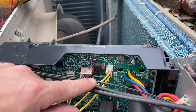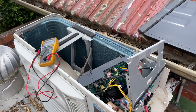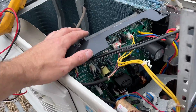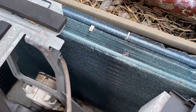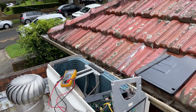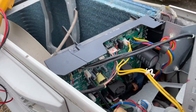There's another fuse just there — it's a 240-volt fuse and should have 240 volts either side of it, but there's nothing. So there's power going to the board but something inside the board has failed. There's no power going through that fuse. To fix the problem we're going to replace the board. That's an easy one — just see if the outdoor unit has power, then check the board, and almost every time one of the fuses just doesn't have power through it when it should.